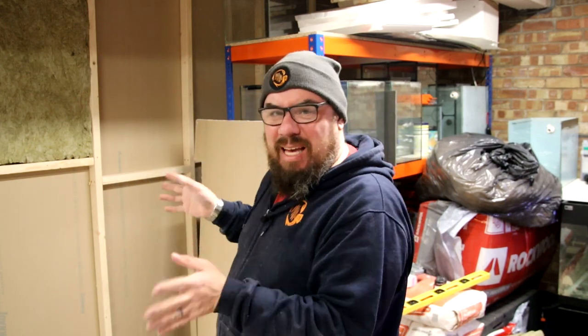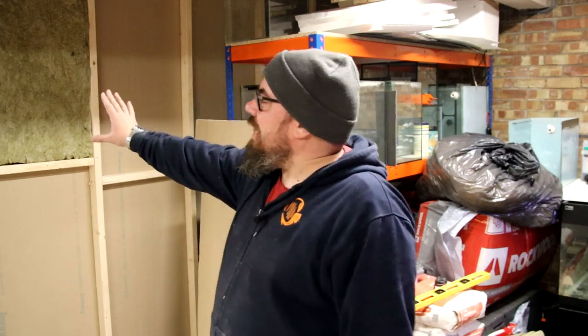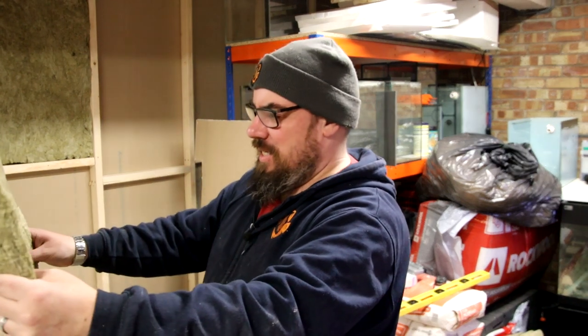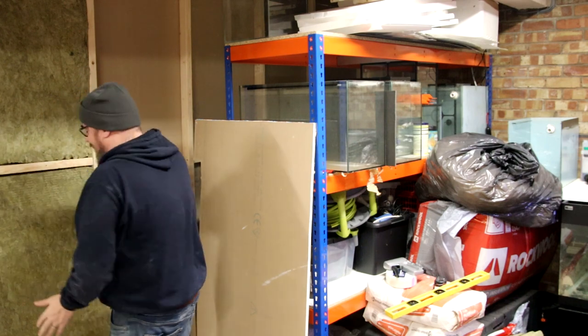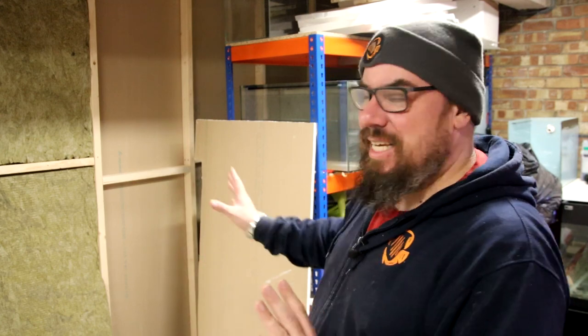We're nearing the end of day one. I've got the main outward-facing wall done — the garage door is there and this is the wall I've built behind it. I just want to get the insulation up in between the stud work. We're using rock wool — it's sound insulation but everyone seems to use it for thermal insulation as well. This was on offer so I went with this. Look at that — fits like a glove. I want to get this wall up so I can get all the gyproc up and the insulation out of the way, which will clear up space to start on the next wall.